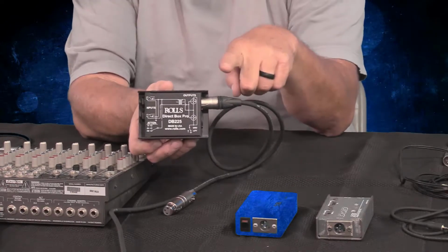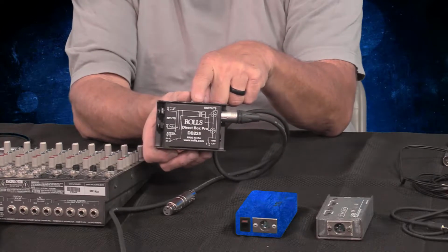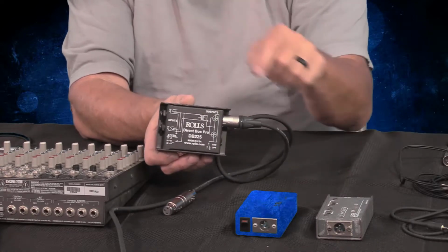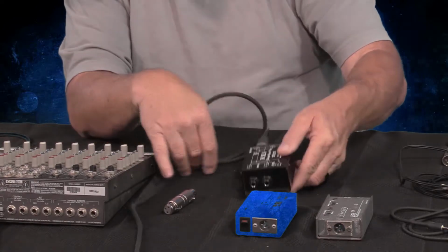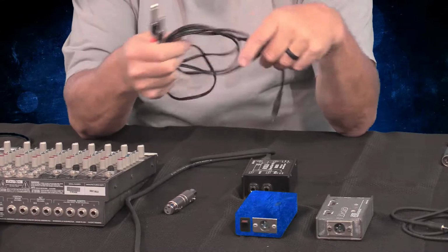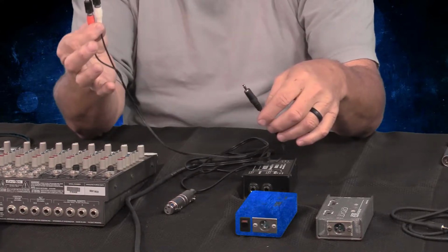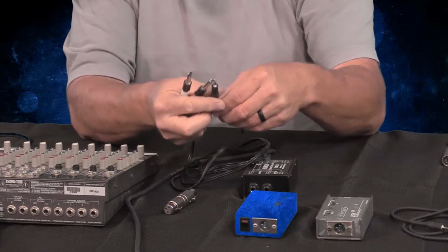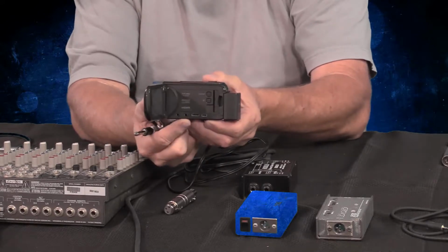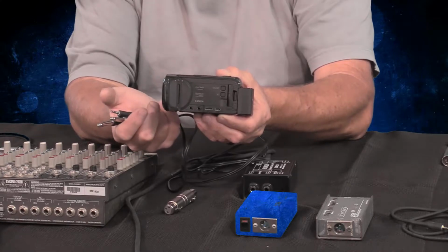Now I've taken my balance line audio, and you can see on the picture on the front, it goes through the transformer, which isolates it, and it goes into the 1/4-inch jacks. So now I'm just going to grab this inexpensive 1/8-inch stereo to RCA right-left, because keeping in mind that for most of these cameras have a mic jack on them, and it's a right-left input. Some of them do stereo, some of them do mono.